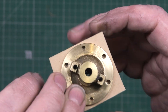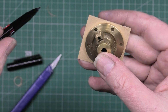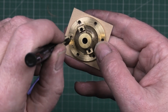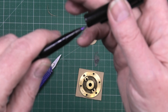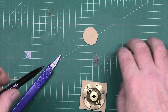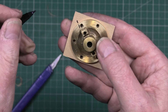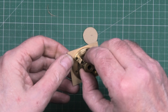The next job is to cut the holes out. I've got a pen. Here's a pen. See, if I had a hole punch this would be much easier, but I haven't. I've only got tools that I've got and I ain't got a hole punch so I can't use one. Because these are handmade it's easier to use a witness mark on there. So if I put a line on there and a line on there, I know that's where it goes. So then I'll take that off.